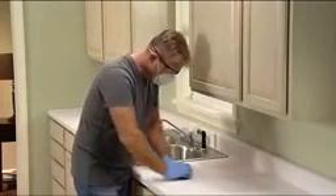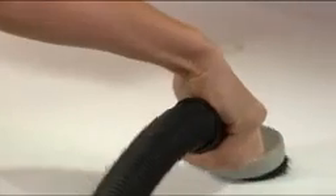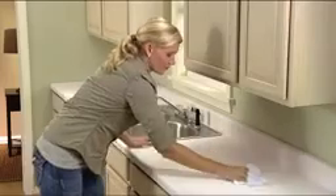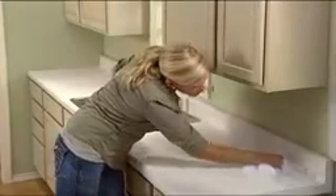To use this special tool properly, place both hands on it, press down firmly, and sand in a circular motion. Continue sanding until your entire countertop is completely deglossed. Be sure to also thoroughly sand the backsplash, back edge and front edge too. Be careful not to scratch your walls and sink. Once this is complete, remove the dust with a shop vacuum using the brush attachment. Or, if you don't have a shop vacuum, you can use a hand brush and dust pan. Then, wipe down your counters with a damp, lint-free cloth and allow them to dry. If you see dust on your hand after wiping the counter, be sure to wipe the countertop again. Repeat as often as necessary until all sanding dust is removed.